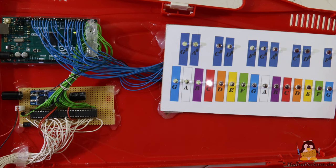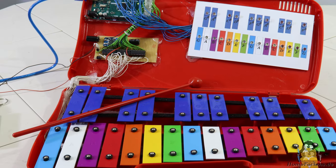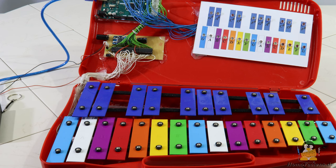The LEDs are controlled by another 25 GPIOs of the Arduino Mega. You could also switch the LEDs in parallel to the coils, but since these are only activated briefly, separate control pins are used instead. The LEDs light up as long as the corresponding tone is to be played, so songs can be learned and replayed. Since the electromagnets are on the underside, the xylophone can still be played by hand despite the conversion.